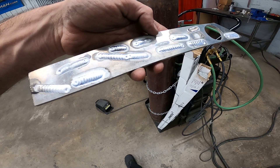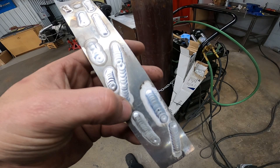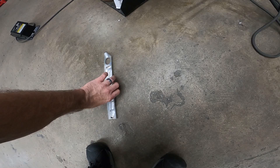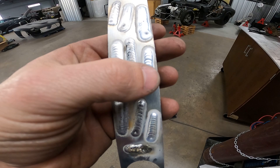You can see these welds are pretty good — those were good bottles. Then you can see this one, see how it's got a little dirt line on the edge. All the settings are the same, but we had a bottle that was really bad. Some are right there on the edge where I can't even hold it in my hand. See, they'll still run a bead but look at the black specks in it. Look at the two welds beside each other — one good bottle, one bad bottle.